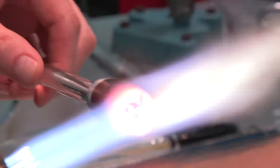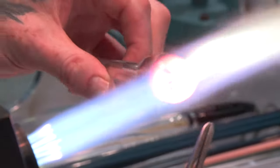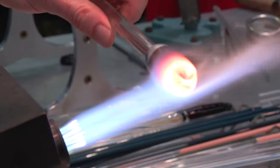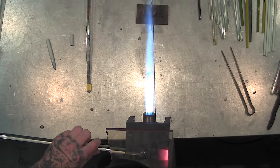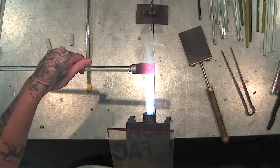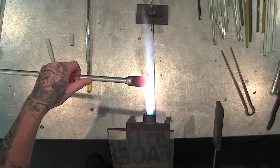And even if you're going bigger, making bigger and bigger murrine, you might have to rehandle or remoil up a couple times. Because eventually, if this mass gets so big that this handle starts flopping, you might even need to transfer it to a bigger piece, a new moil every time.